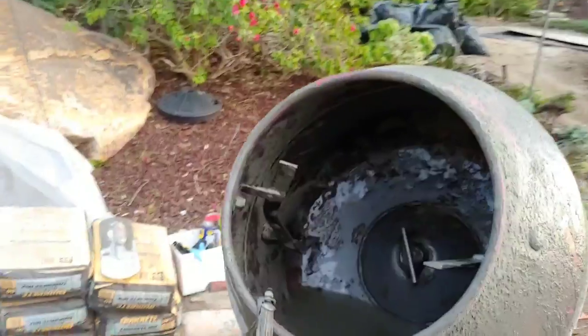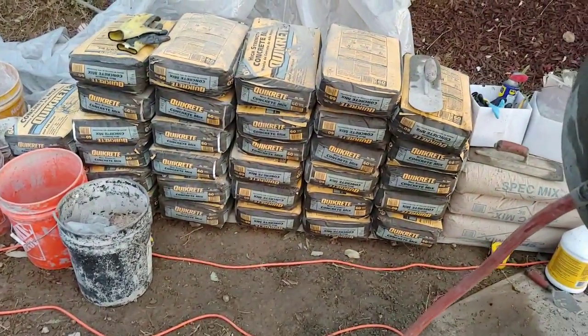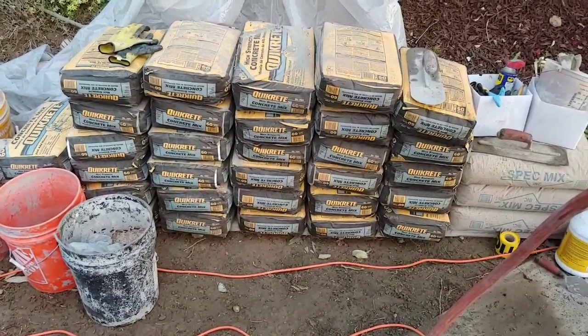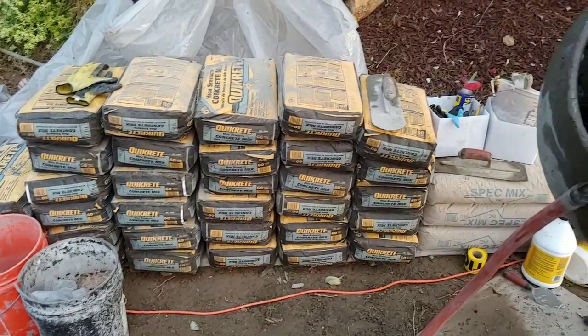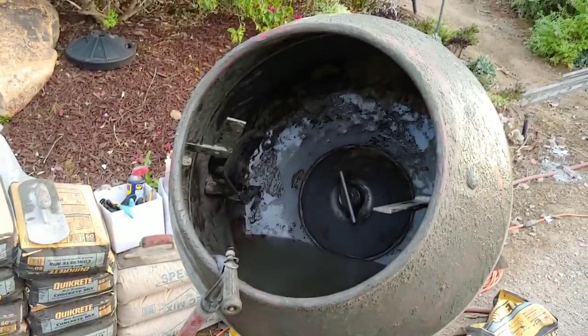Dave out here on the rock pile in Poway doing the slide. This is our pre-pour concrete that we use before we get the shotcrete truck in here. We finish out little detail areas and set some finish lines for the shotcrete guys so they know where to finish to, like down on the slide.